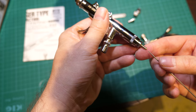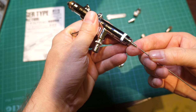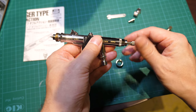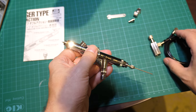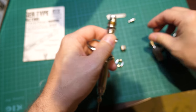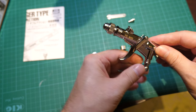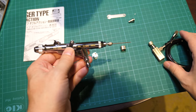Let's just put it back together again. Be very careful when you insert the needle — I use my finger here to guide the needle and then push it through. Never force it; it'll go through. You just see it come through the end there to the cap. Then this retains the needle so it goes back and forth. Let's put on the normal nozzle cap — the circular pattern one. That's a retainer. Now let's mention something about the airflow adjuster — I have no idea what they meant by that. We'll look into that as we read through the instructions.